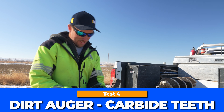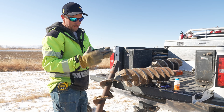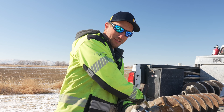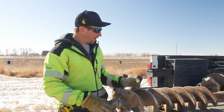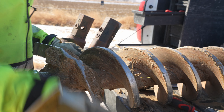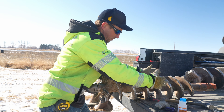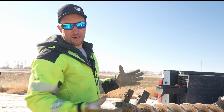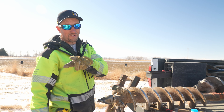We're going to show how aggressive this next setup is. This is a carbide fishtail or pilot bit versus just the standard one. This one is going to outlive the standard — you're going to get a lot more life out of it, but be prepared because it costs almost three times as much. See the links below on the carbides and fishtails. We also want to talk about what we do to our augers — you can see on all three of them how everything has a thickened edge. We take rebar all the way around the flighting of the auger and go back across with some hard surfacing weld. This area gets a lot of wear and tear. With a nine-inch auger, you could end up with an eight and then a seven because you're not maintaining that portion of the auger — it turns into an ice cream cone shape, and you'll get frost heaving of your post. Auger maintenance is very, very critical. If you haven't seen the auger maintenance video, make sure to watch it.